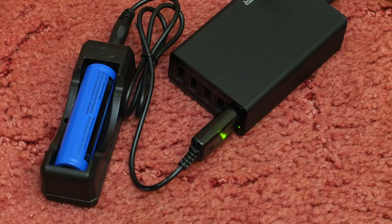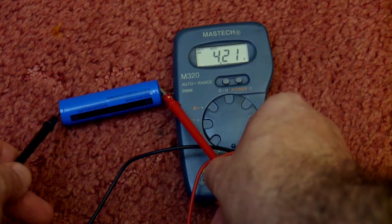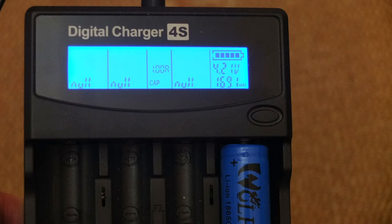I'm charging this with the supplied mini charger to see how it performs. Once the charge is complete it turns from red to green. Running it through the USB tester, you can see there's just a slight current so it does pretty much shut off, and it charges the battery to an optimal voltage of just over 4.21 volts. Unsurprisingly the capacity is lower than stated, though it's somewhat better than some of the super cheap eBay batteries I've used.